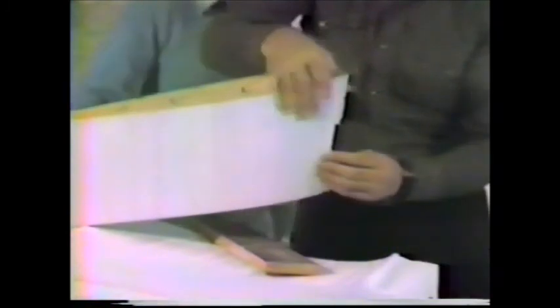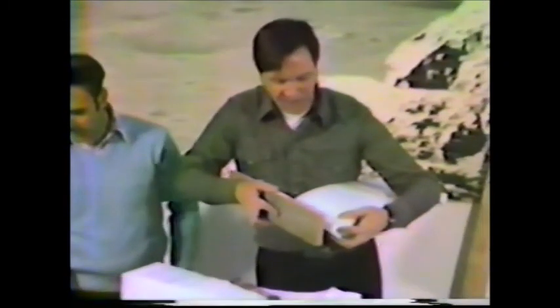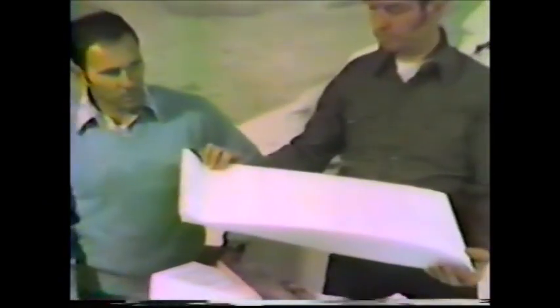We notice here the wire was lifted off the template for a while and there's a ridge — best to take a hard block and remove that ridge by sanding to get it down nice and smooth. Then we get a knife and pull off the leading-edge flash. On the leading edge, you have to be very careful not to change the airfoil shape when rounding it down. Use the sanding block to remove the flash, not taking off too much, keeping exactly the right airfoil around the leading edge. The part is now ready for jigging for the layup.